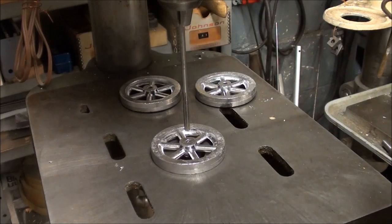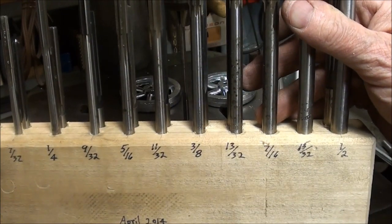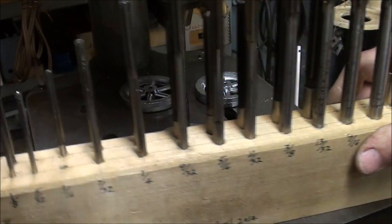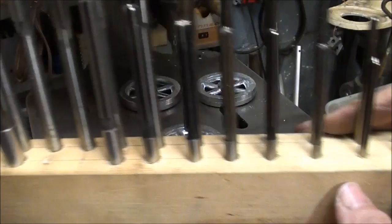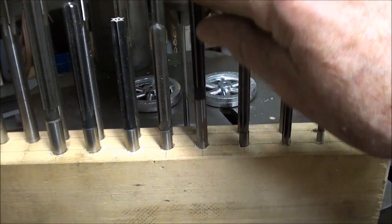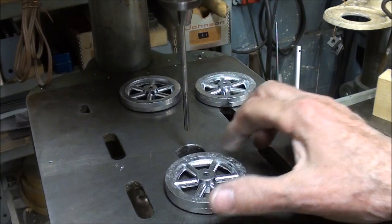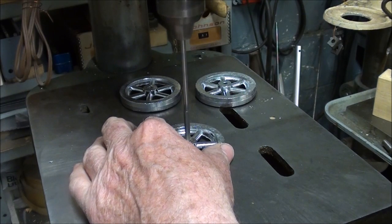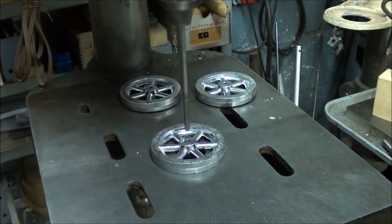I'm getting ready to ream that center hole, 3 sixteenths. I don't need to drill it — reaming is going to do it. I like my handy reamers in a carrier here so I can take them around to whatever machine I'm working on. I put an extra row in there, so I have my machine reamers and chucking reamers in the front, and then the appropriate same-size hand reamer on the back. That's going to save me a lot of time. In reaming these, remember the hub is thicker than the rim, so I just put the hub right into the hole. I don't even need any fluid or cutting oil on this. I'm just taking a little out of it — getting rid of the taper, that's all I'm doing. A perfectly reamed hole.